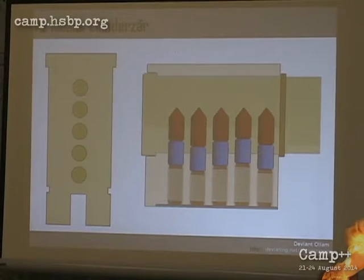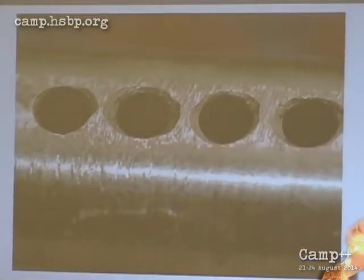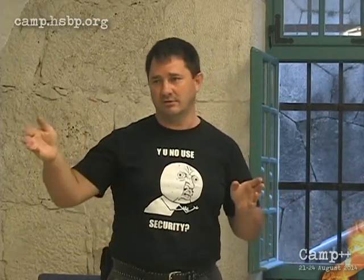In reality, we don't have perfect locks because we have production, and the production is not accurate. Tools are getting damaged and they are not as accurate, and the failures in the accuracy are adding together. Finally, if you look with a microscope, the holes are not staying aligned, and you can see the small damages or inaccuracy points which are coming from the production. So production is not accurate, even in serial production where the tools are getting damaged, and then you can see the failures.